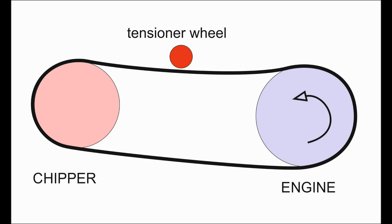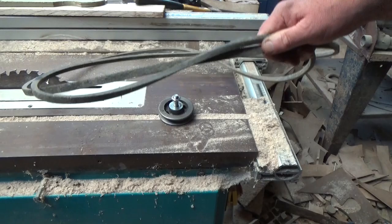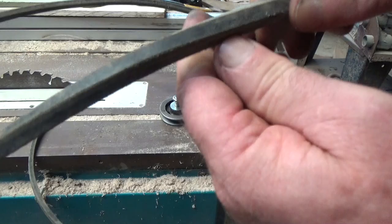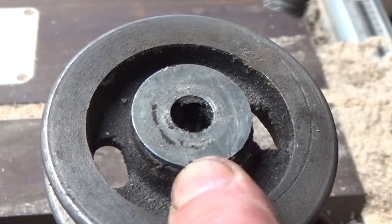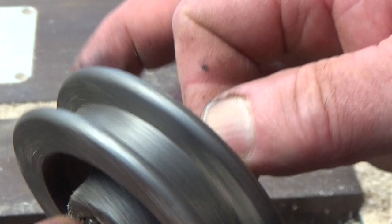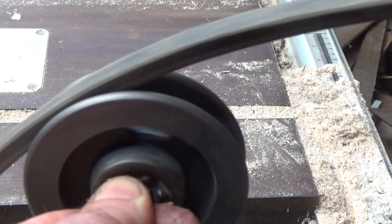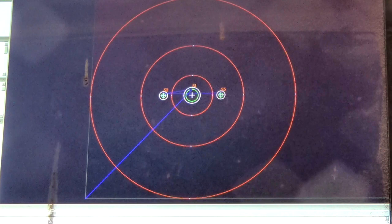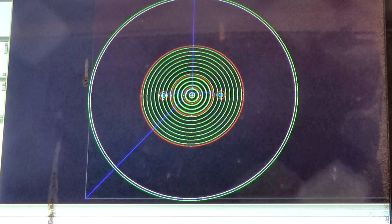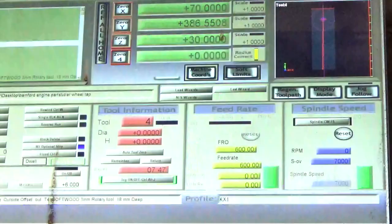Either that or the belt will get snarled up in something and horrible things will happen very quickly. Anyway, I found a long V-belt and a pulley wheel which is solid and has bearings built in. If the V-belt is turned inside out, it fits very snugly between the flanges. I think I need to extend the flanges so they gently guide the belt even when it's loose — that's what should keep the V-belt on the main pulleys. So I made extra flanges out of plywood on my CNC router, but first I had to figure out how to ask the computer to cut different depths so it would fit the pulley perfectly.